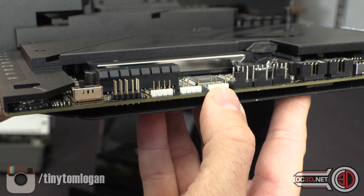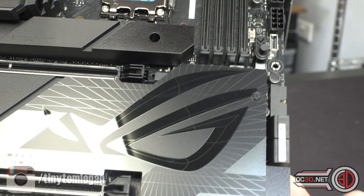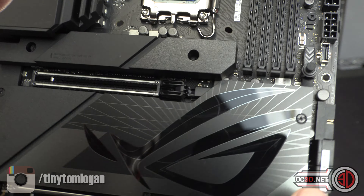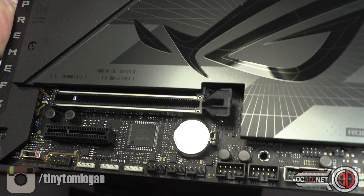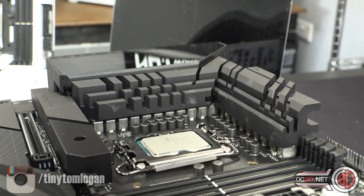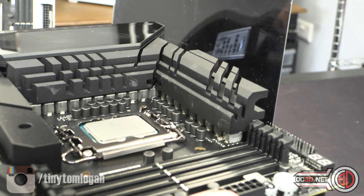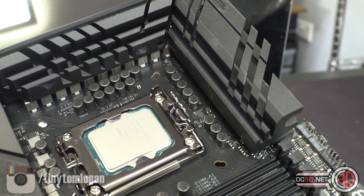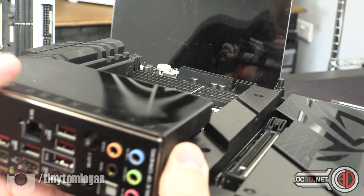There's a small water cooling section down here with water flow, water in, and water out sensors. Another USB 3 down here, this one shielded as you can see, plus a couple of USB 2 headers and three more fan headers. Turning it around, you get three more RGB headers — two are 3-pin addressable and one is a 4-pin non-addressable. You do get a couple of full-length PCIe x16 slots, though the bottom one is only wired to x8, and then there's an x4 slot below that. Information on the power delivery beyond the amperage specs has been quite limited and what I have had was watermarked.